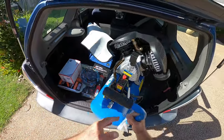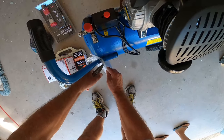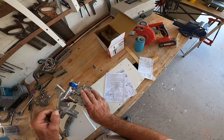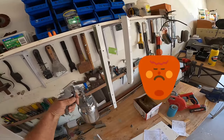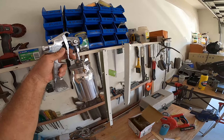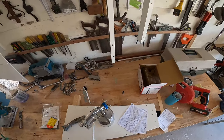I've been experimenting with the roll and tip method for 2-pack polyurethane for a while now, and sometimes I've got reasonable results, but the variables are too many and too great — temperature changes, wind speed changes, humidity changes, the product changes, thinners flash off, and viscosity changes. I just haven't been able to get consistent results. So I've decided to bite the bullet — I've bought a little compressor and a spray gun. I've got a client to do some work for and I want to produce the highest quality possible. Spraying is the way to go.